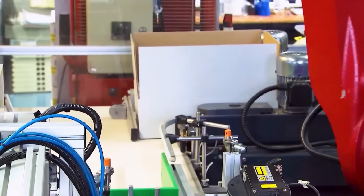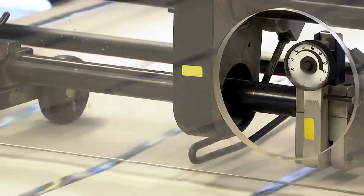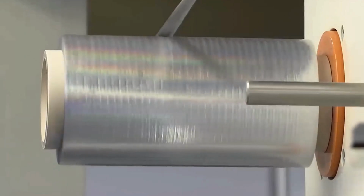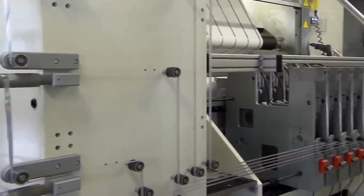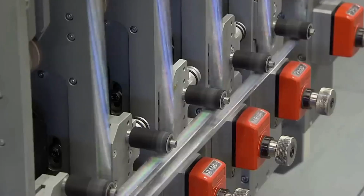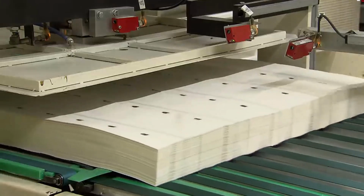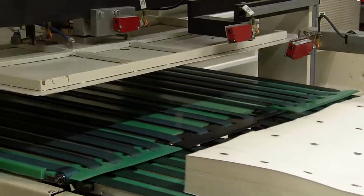During the sheet formation process, a watermark featuring the European gate and the numeral 100 is embedded into the paper. When held up to the light, the watermark becomes visible, along with a silver security thread embedded into the paper. This thread displays the euro symbol and the numeral 100 in tiny microprint, and it glows pink under ultraviolet light. Once the paper sheets are formed, they are carefully dried and inspected for any imperfections. Only flawless sheets proceed to the printing stage.